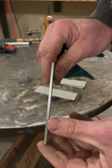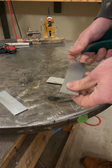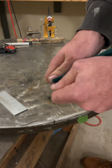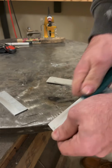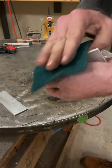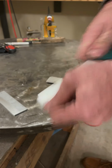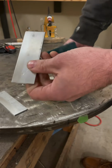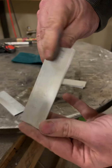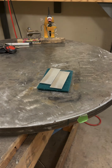Now the surface there, not bad, not bad. We're going to acetone wipe that when I'm done as well. Same thing here. Realistically, pulling it in one line is probably better, because if you rub it back and forth, which I have a tendency to do, you can embed more material. But this stuff is pretty clean. I'm honestly not too worried about it. So again, you can see the massive difference here versus the clean, edges clean. Grab some acetone and wipe that down.